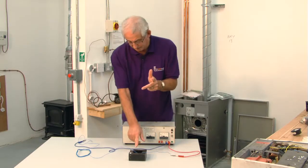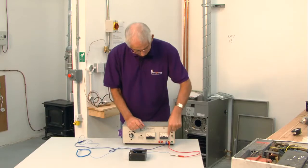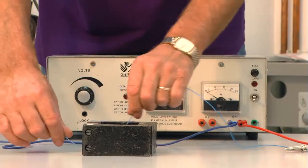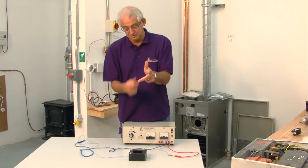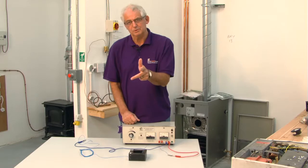I've got a magnet here — we know that's the north pole and that's the south pole. I've also got current that's going to flow through it that way. So if Fleming's left hand motor rule works as it should, you can see the motion of this conductor when I turn it on or pass current through it — it's going to go upwards.